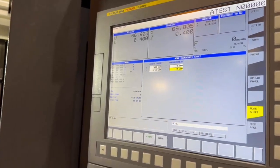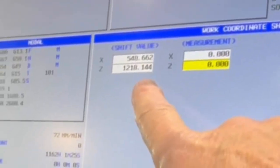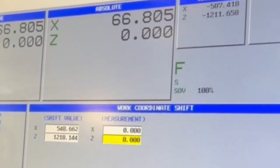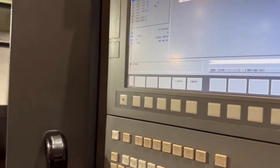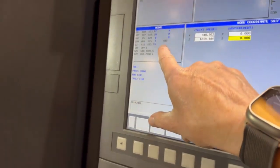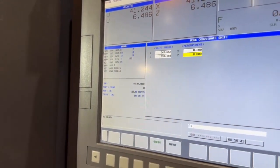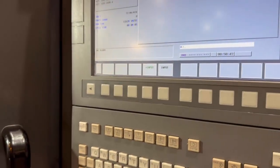It will change that Z figure — you can see it's changed to 1218144 — and your display is reading zero because that's where you are. That's got the tool offset and the work shift set. If you press reset you'll see it jumps out because it just dumped the tool offset, so if you did it that way you'd definitely get the wrong figure.